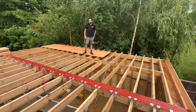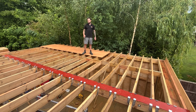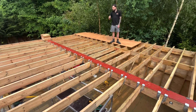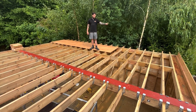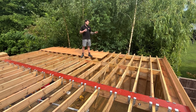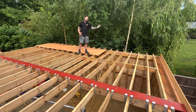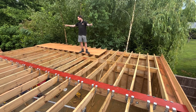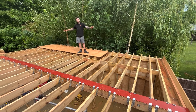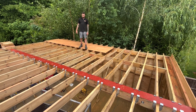That's all the joisting in. We've got pretty much all the noggins in — the perimeter ones and a central row — with one more central row still to fit. All hangers are nailed up, everything's bang on, and we've tied the walls into the ceiling. We're also going to get two lateral restraint straps underneath hooking onto the outside of the wall at each end to lock it all in. Next stage is to counter-batten for airflow, because with a cold deck roof you want a decent amount of airflow to prevent any condensation build-up.